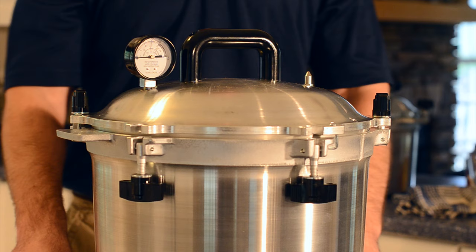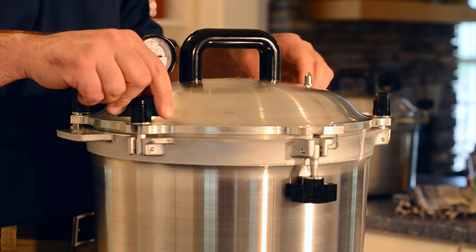If there isn't, tighten the side that's high and loosen the side that is low at the same time until the gap is even. The wing nuts will be snug while you are doing this. Do the same thing with the second set of wing nuts, making sure to keep the gap even between the cover and bottom.